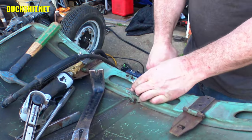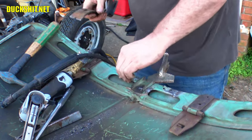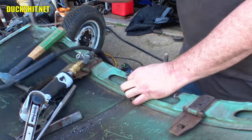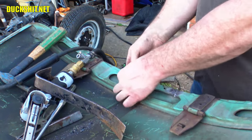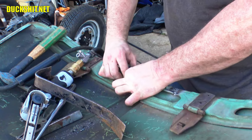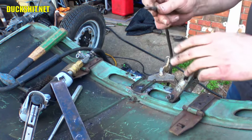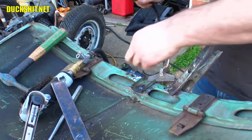I'm gonna plant back on here and put a little weld on, then beat on it a little more. I don't like how this is sitting though — that's more like it, had to come up a little bit. I've been clamping my wire like this lately because I get a better ground — actually clamping the copper right against the steel part. I don't have any of those grounding problems I used to have a few years back.